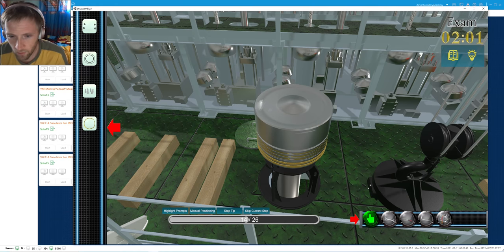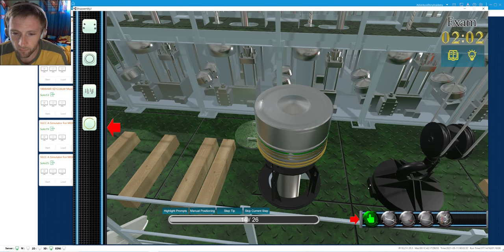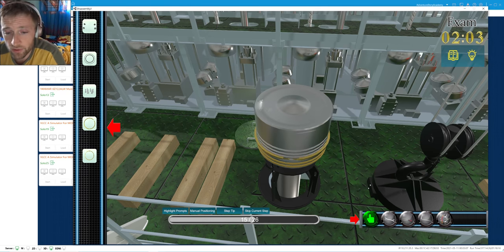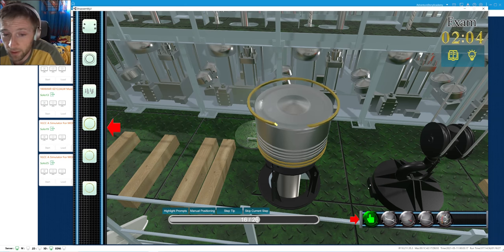We select also the other rings. Some of them can go by hand - as I have seen also in diesel generator engines, the oil scraper rings can go by hand. But some of them are really difficult to take out. As you can see there is a second ring, third ring, and fourth ring.